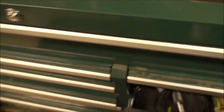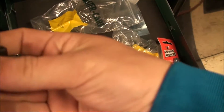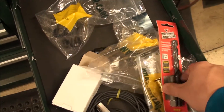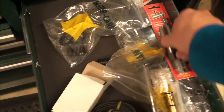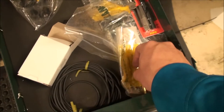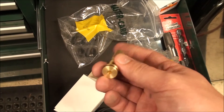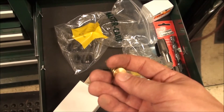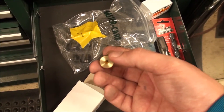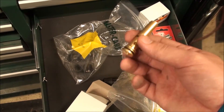I've got all the parts in over the last few days - all the wrenches, here's the locating pins, I did some tests on those. I've got all my MPT threads. And here's the vacuum generator - I got that from Air Vac Engineering at a pretty decent price. It sucks in about 4 CFM and it's going to put out about 28 inches of vacuum at 70 PSI, and it was only $35.